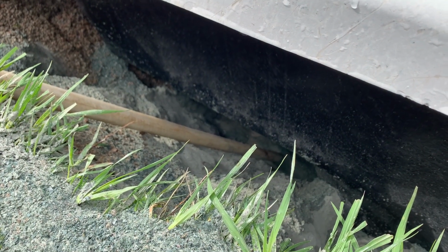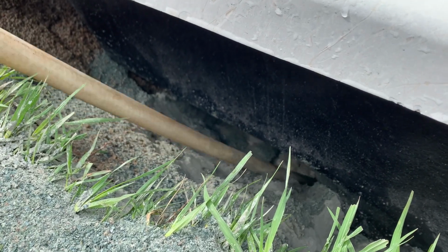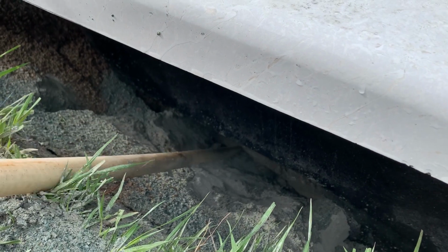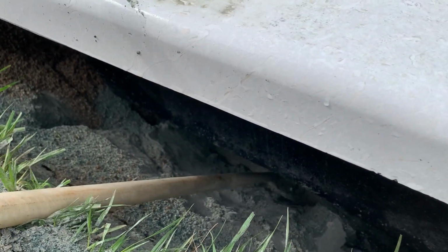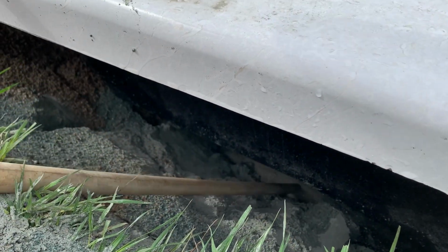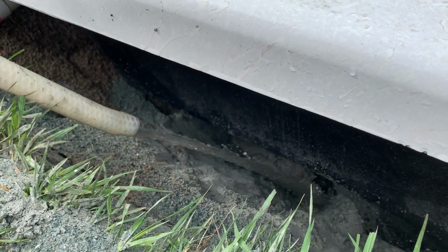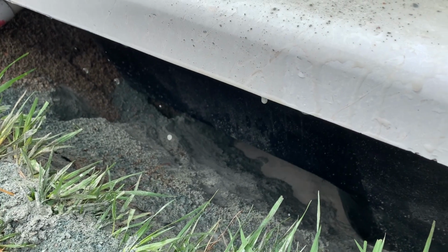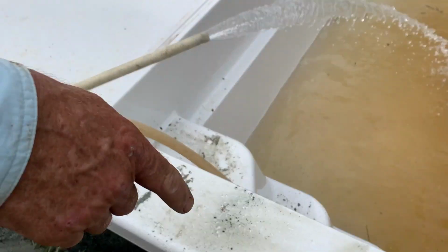You can see here that just a garden hose is just not going to cut it. You're just not going to be able to push that water right down to the bottom, and it's just not going to push out at the pressure that you need the water coming out at to get the backfill washed in and around. How much pressure, how much water pressure do you need? What this shot here just gives you an idea of just how much water is coming out of that submersible pump compared to, say, what your garden hose is going to be throwing out.